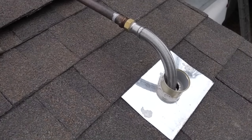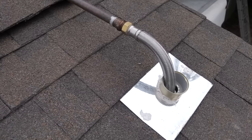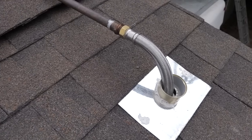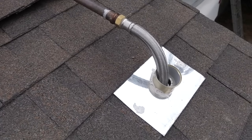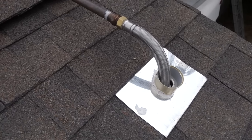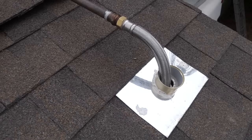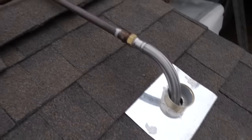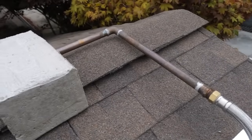Up there they go through the roof. Now we'll go up on the roof — here's where the water line comes through the roof. I made the connection with a flexible connector that's usually used for connecting to water heaters. The flashing I made from some aluminum sheet metal I had on stock and two Fancy Feast cat food cans, one on the top and one on the bottom.